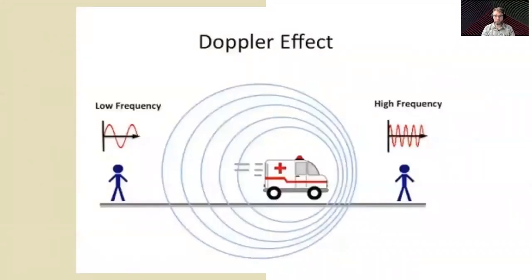With the pass angles, we also need to talk about some basic physics called the Doppler effect. The Doppler effect is a physics phenomenon where as a signal is moving away from you, you perceive it at a lower frequency than if it's coming at you. The most common real-world example is ambulances — when you hear a loud ambulance or fire truck pass you, it starts at a high frequency and then shifts as it goes. The Doppler effect is also famous in astronomy: we can tell that stars are moving away from us because the light on them is red-shifted, shifting to a lower frequency.